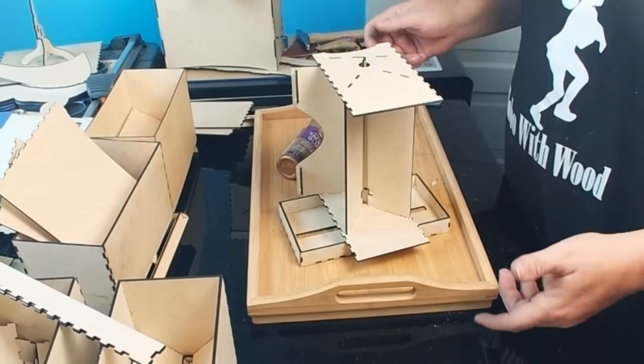All right, once you got her flush like that, probably start to walk her down. You want to be careful, because if you put too much pressure on this, you can actually get that to cleave and break, split in two. So you want to be careful pushing this on. I thought I made these a little bit larger. There we go. So I didn't have to fight this so much, but you still want these good and tight. And just work it side to side.